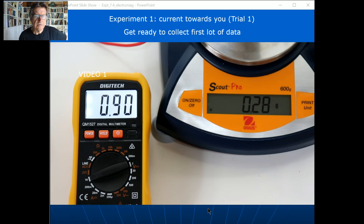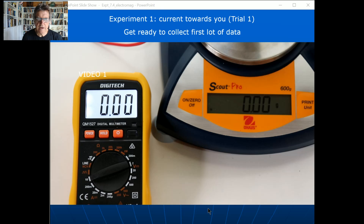Winding it up — it's starting to get hot now — there's 0.9 somewhere in there, fairly steady. Then I'll quickly do the last one, up to one amp. It's tricky to get it stable but there it is — take a reading; the scale reading isn't changing much. Then I wind it back, check the balance goes back to zero — no zero error has crept in. Good, it's back to zero.